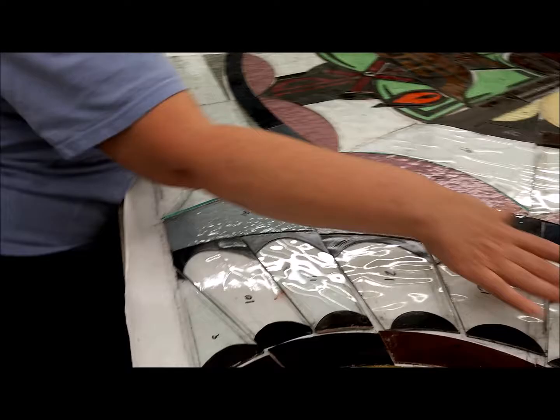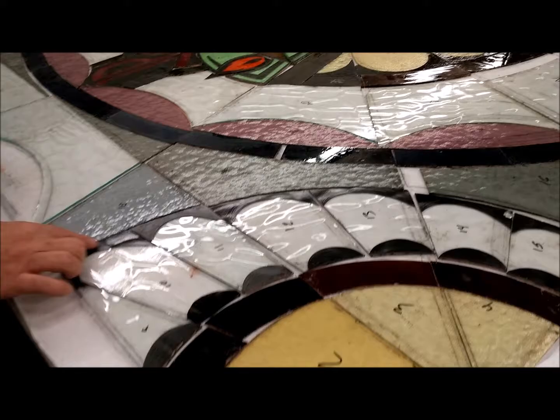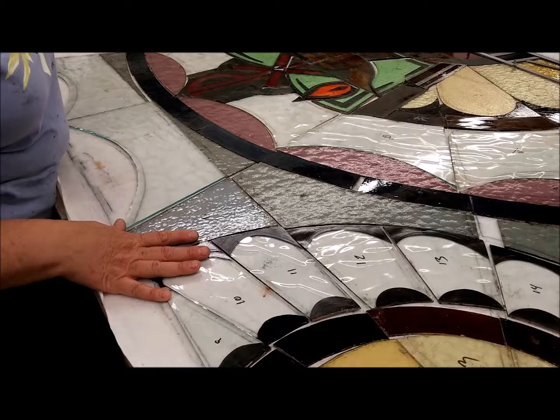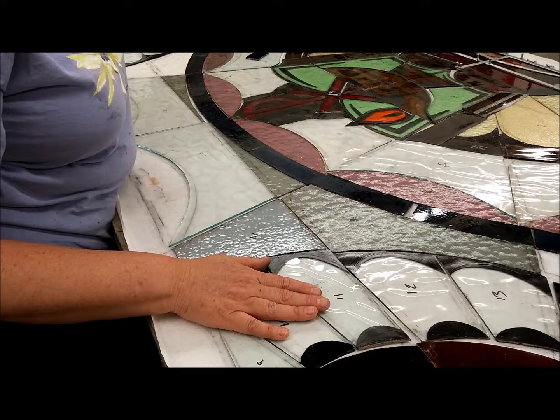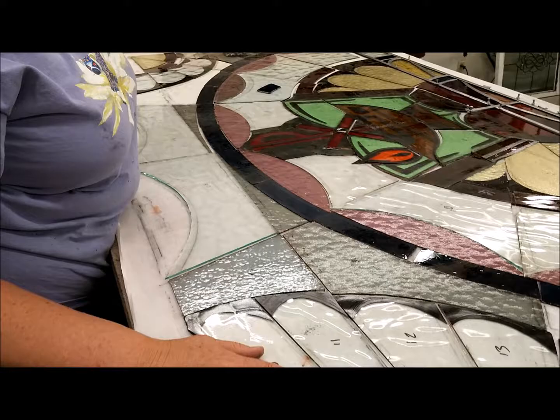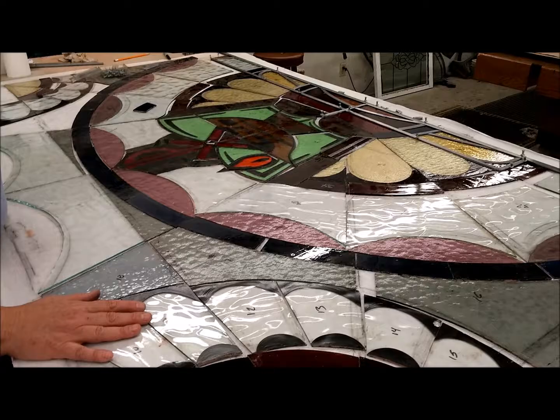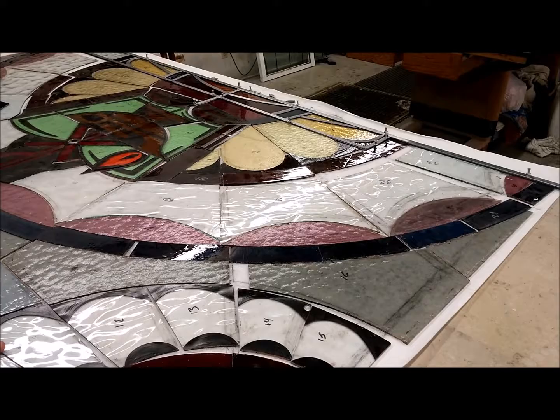Matching these lovely daisy pieces — you can see these are a little shinier than the original ones. When we clean these up we're using a rare earth item called cerium oxide, which stone polishers use to polish stones. We're using it here to remove the surface acid rain damage and any etching the acid rain has done, so we're cleaning it up.